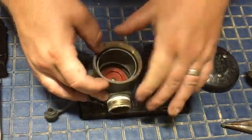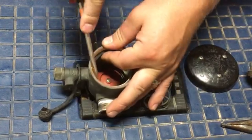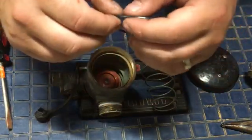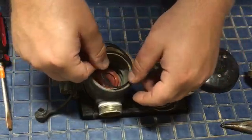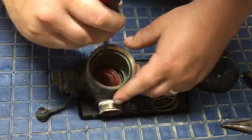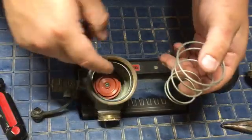This can be a little tricky to get in, especially if you've got fat fingers, but that drops in. There's also an o-ring right here. To get the old o-ring out you can just peel it. You can see how this one is very flat — after a while they get flat. The new o-ring in the rebuild kit will come with a food-safe lubrication, since this is attached to drinking water. Don't use petroleum-based products. Lube the o-ring up and put it back in.